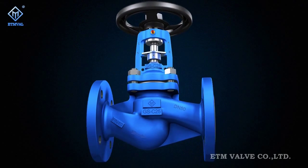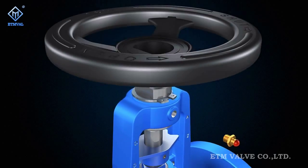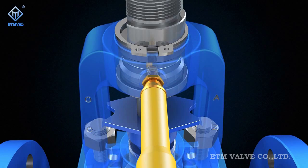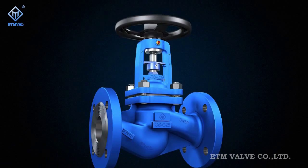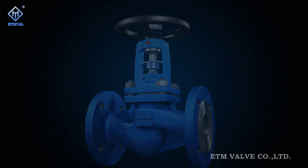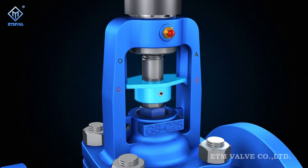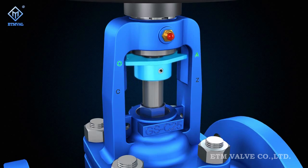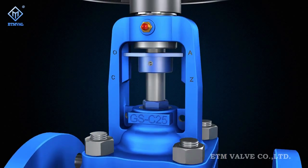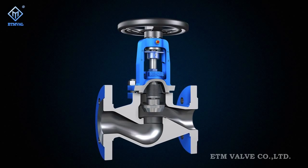For Figure P series, the stem nut is retained with a circlip and has the feature of storing lubricant. This design ensures that phenomena such as nut break-off, seizure, and abnormal sound given off during the valve open or close cycle are totally avoided. Figure P series is also designed with a legible opening and closing indicator, from which the operator can clearly know whether the valve is at its full open or full close position. Another function of this indicator is to prevent possible damage to the bellows assembly caused by stem spinning.